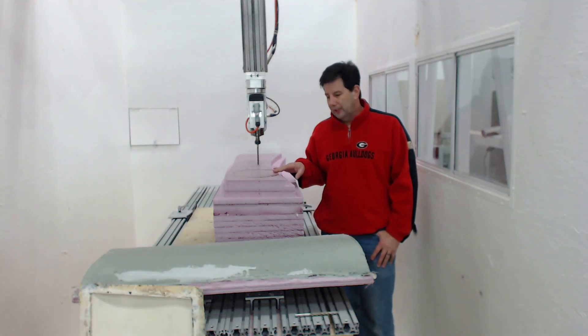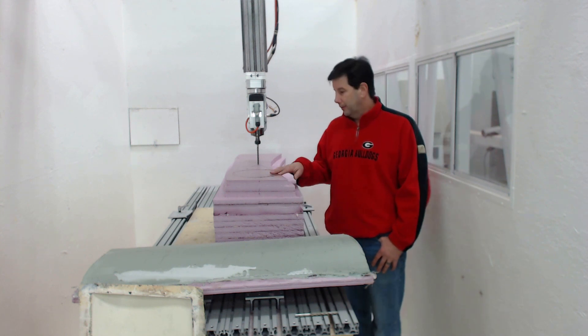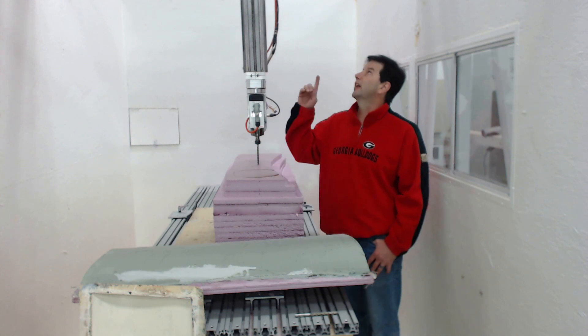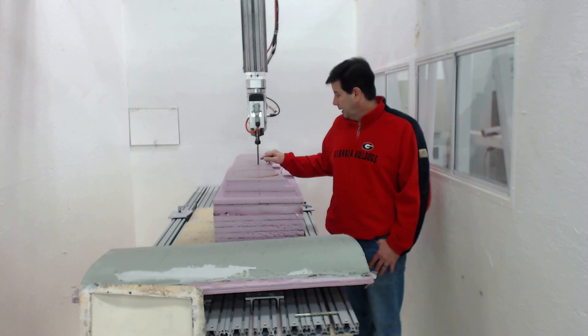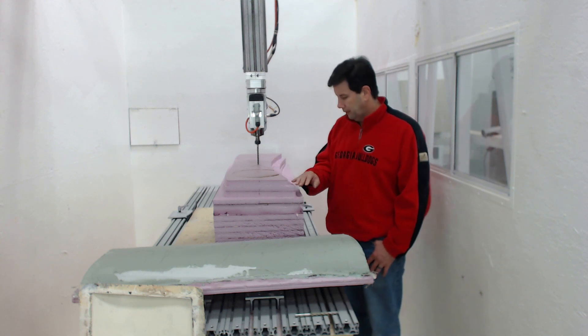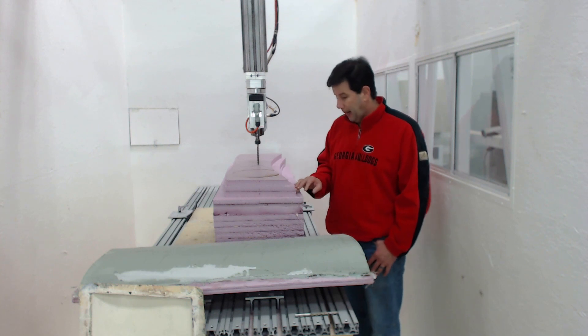I'm hoping to salvage the rough cut I did originally — this 3-axis rough cut. I actually had a little indentation on here caused when I was standing up there trying to put in the new stop system. So I'll drop the bit down 10 millimeters, do another rough cut to get rid of that little area, and then get back to the 5-axis.